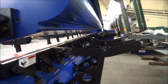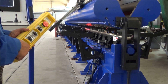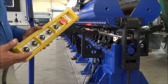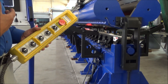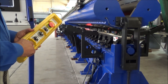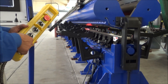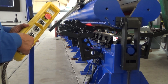We also have the load rollers. These are the load rollers that come up to a predefined position so that you can load the skin. The actual shell can be loaded through the front of the machine and pulled by the loader arm to get it into position. Once in position, you can bring in the other rollers. These rollers will accommodate to the diameter of the part, allowing you to rotate the part into position to the center line of your weld.